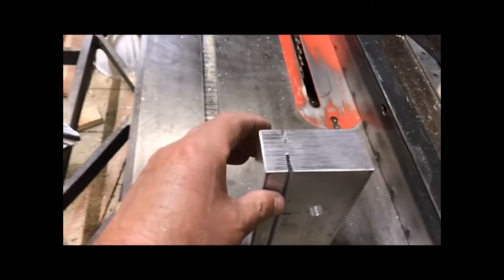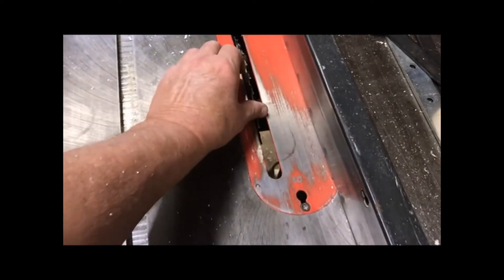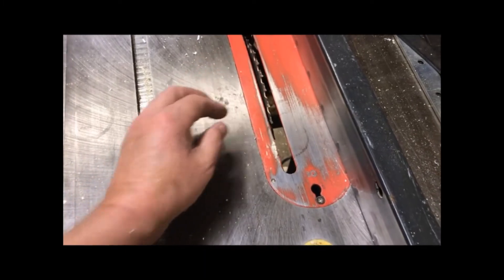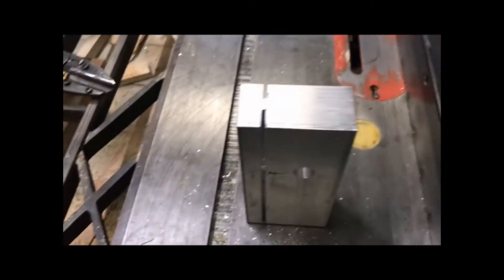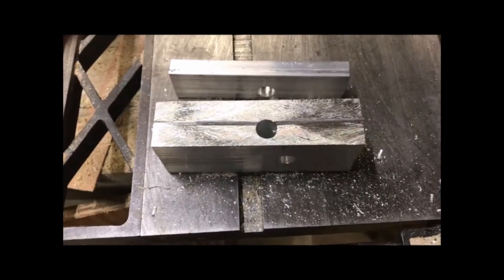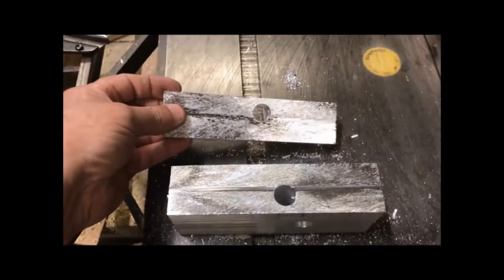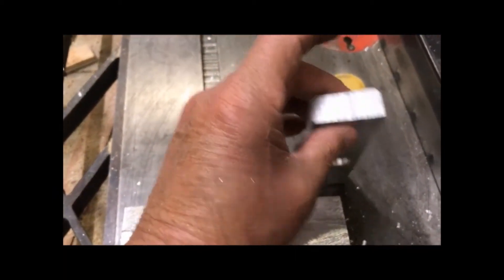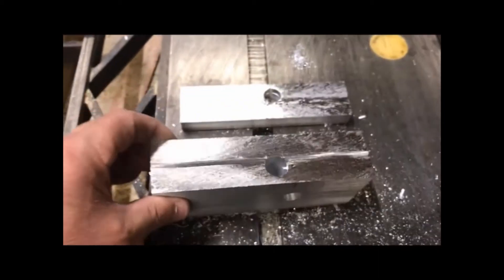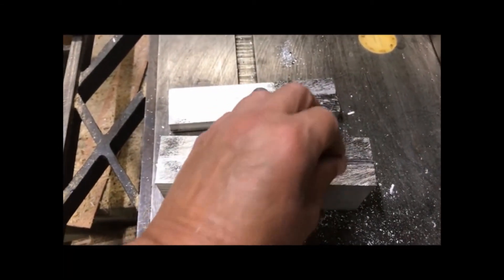You can cut aluminum on a table saw very slowly, very carefully. I chose a carbide-tipped blade that I had tried to have sharpened one time before and they said it was cracked — so a sacrificial blade, and very carefully cutting. I did manage to cut it with that old carbide-tipped blade that got somewhat dull and they said they wouldn't re-sharpen because it had chipped teeth. But it did a pretty fair job. You do it rather slowly, don't get in a hurry — you can't hog it through like you would cutting a two-by-four. But it did do what I asked.